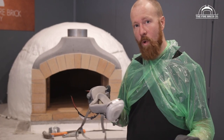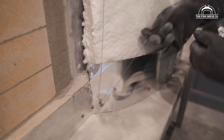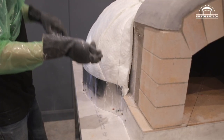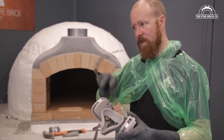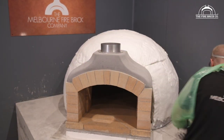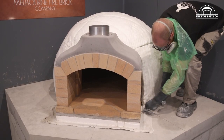Any time you're working with the blanket — all the way up until just before you're actually rendering the dome — we really recommend keeping your mask on and wearing all your safety gear to prevent inhaling any dust particles. As you're fiddling with the blanket, lashing it down with tie wire or putting chicken wire over the top, you're disturbing it and releasing little fibers that you don't really want to breathe in. So wear your mask, wear your safety gear, and be safe.